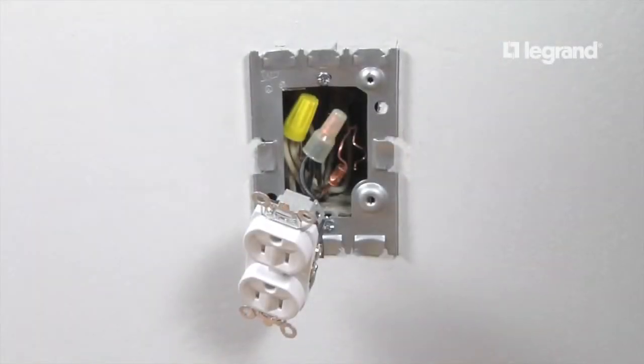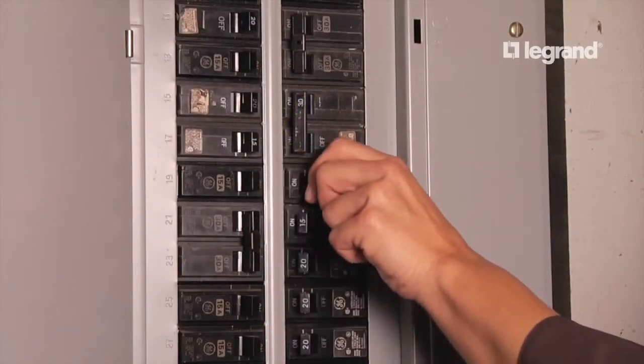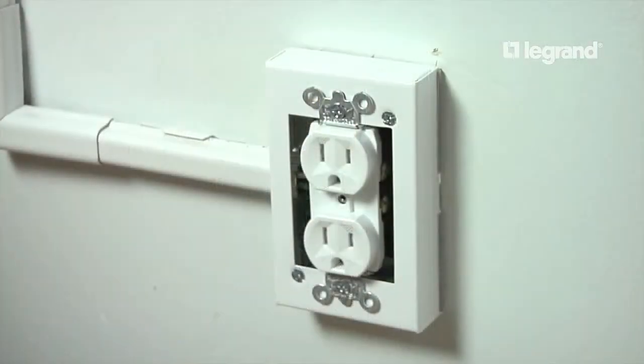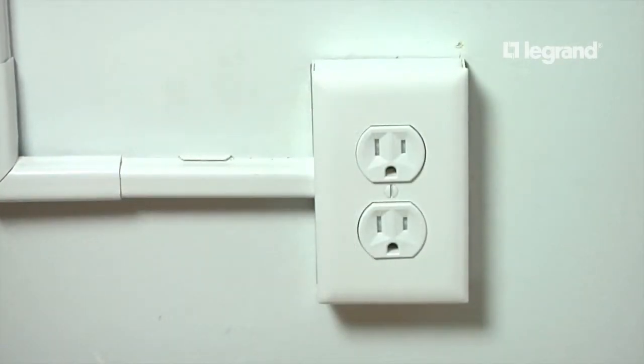The installation of the starter box base is the first step in the process. Again, make sure the power is off. The starter box will house the existing wiring and feed the downstream wiring, which, in this case, is 14 gauge. Whether the ceiling fan has a light or an attenuator will determine the wiring configuration.